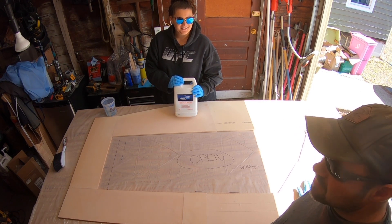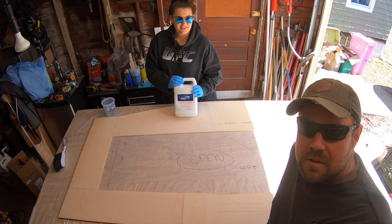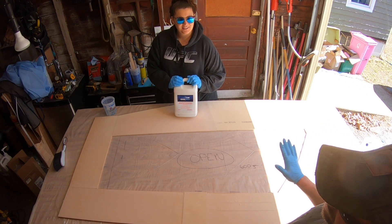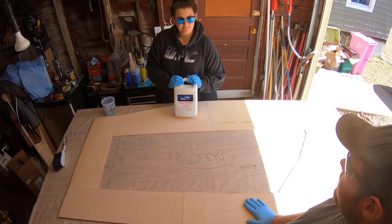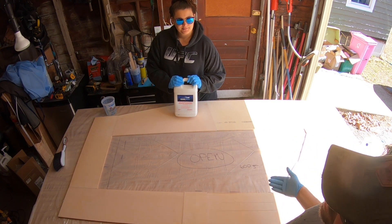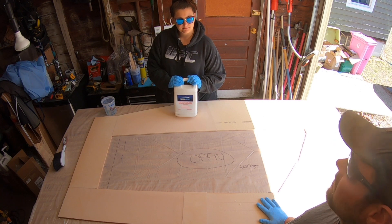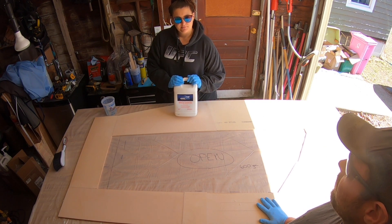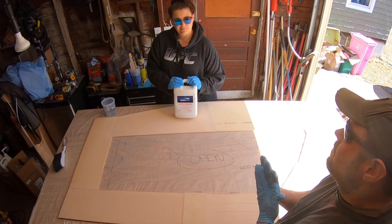We are using medium hardener today because the temperature is pushing 55 degrees with the door open. Sun's shining — good to go. We're doing one layer of glass on this and just a peel ply, and that's it for this panel. Flip it over to the other side, do the same thing, then move on to the last four floor panels after this. We're in pretty good shape for spring, and hopefully soon we'll start getting back out to the boat. Thanks for watching guys.